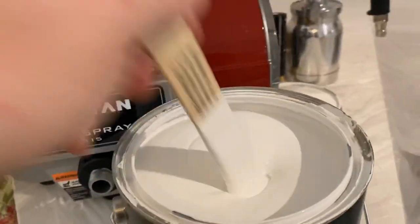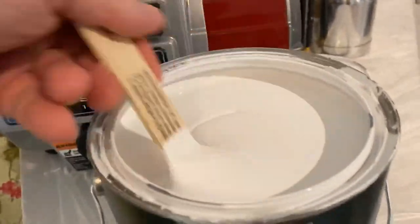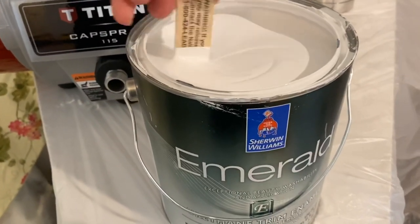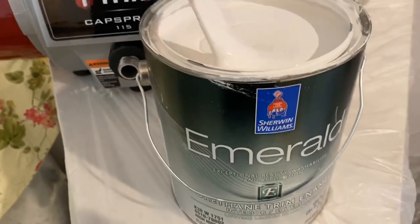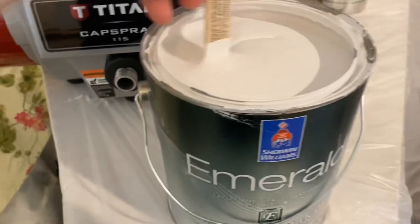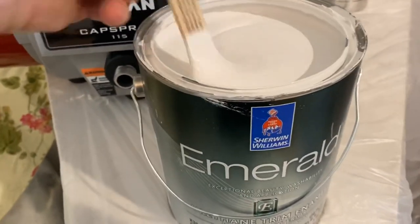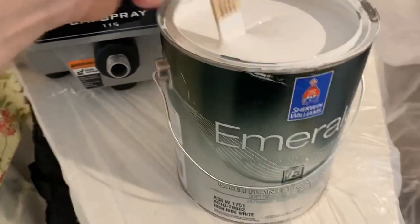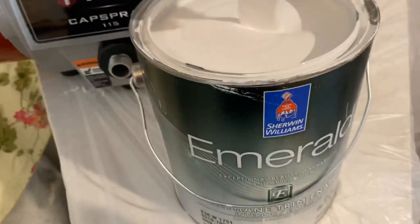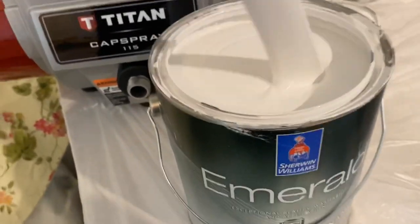Now, as you can see, this is a full can, but I'm stirring at the bottom. I'm kicking up the bottom. And so for those of you who paint, you know, this is a little boring, but I have a lot of do-it-yourselfers who watch my channel who, without exaggeration, open a can of paint, forget to get paddles at the store, give a little shake in their hands, and then they're done with it. But little do they know, paint generally sits on shelves for about 90 days. And after 60 days, you have about an inch of thick coagulated paint on the bottom.